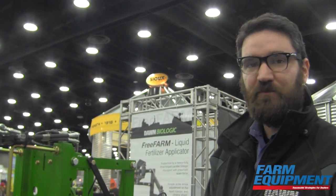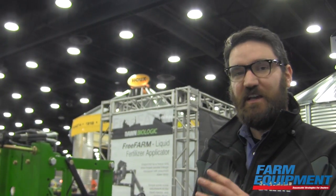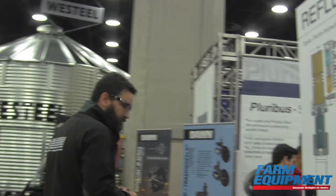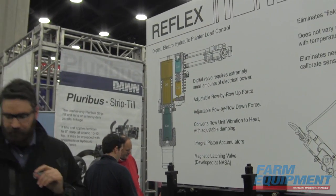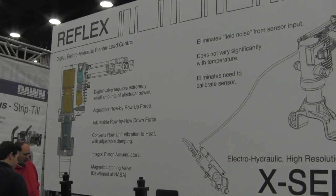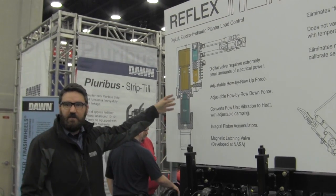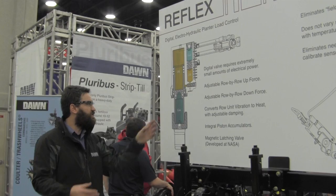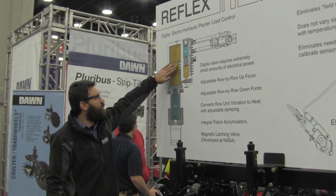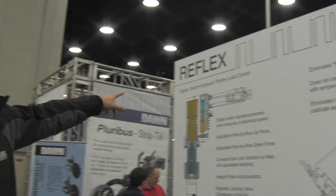This actuator design is something I'm personally very proud of — what it does is extremely complicated, but what it is is extremely simple. People in hydraulics manufacturing would call this a linear compensator. The design has two accumulators; one accumulator is concentric with the piston. The cylinder rod is relatively large diameter because it has a piston concentric with gas pressure underneath it, so as the system moves up and down, oil enters and leaves, compressing the gas.